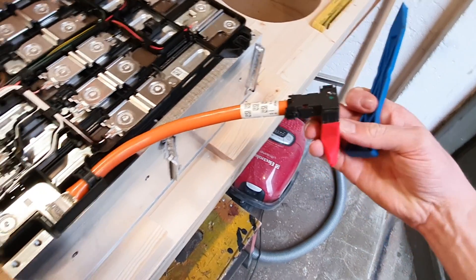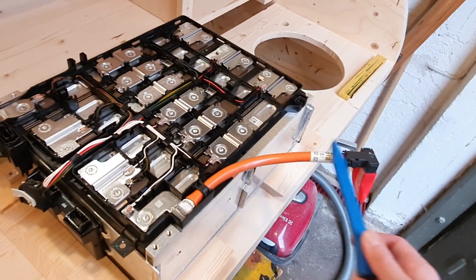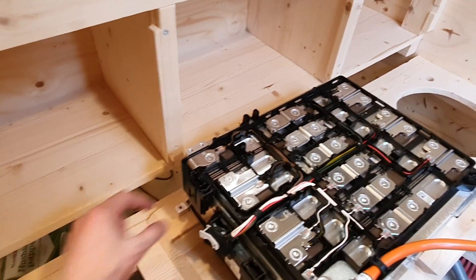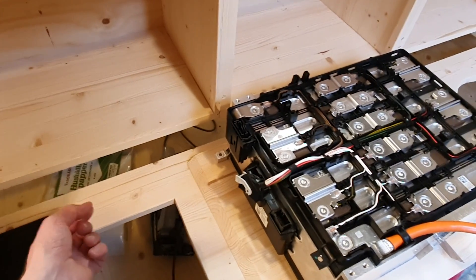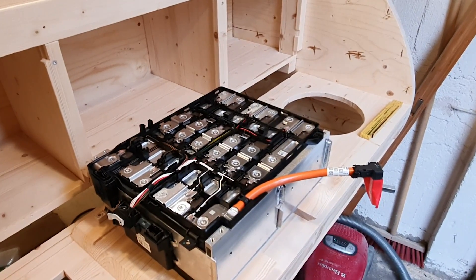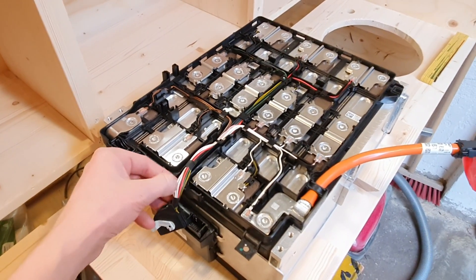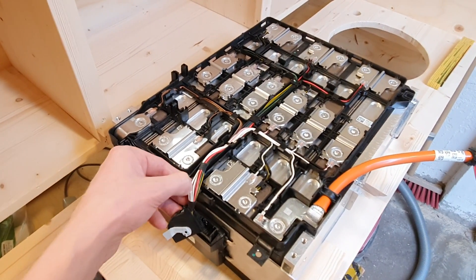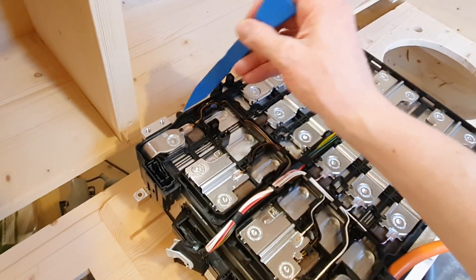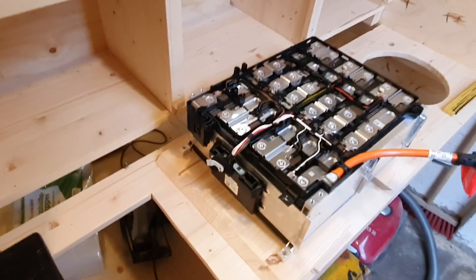There's another way too — when I disassembled this battery I got a few of these cables with connectors. I have an extra one that goes to the negative, and I drilled a hole in the metal tab at the end of that cable, so I don't have to take this apart at all. For the BMS wiring, you just cut the wires one by one without shorting them and solder on your new BMS. It's really easy to see which balance wire goes where.